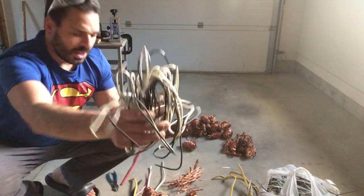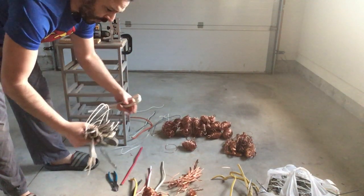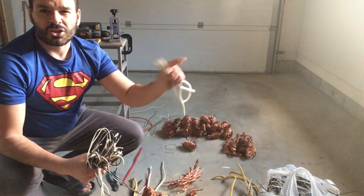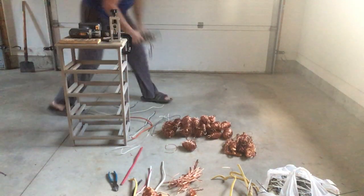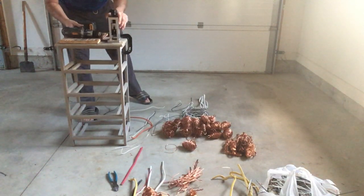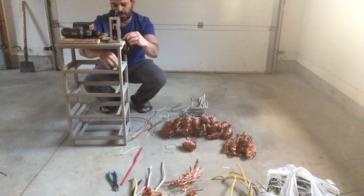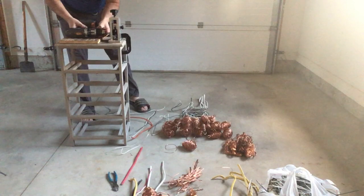Here is my end result. One piece of advice when you wire strip, you wanna keep all of your same size wire together, because if you have it all mixed up, you're gonna spend a lot of time changing the height of your cutter blade. So that is one important thing you want to do, is make sure you check. I'm also gonna put a C-clamp on this bench just to keep my stripper intact so it doesn't vibrate and come off. I'm gonna attach my drill.